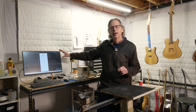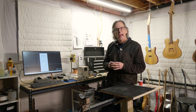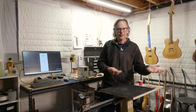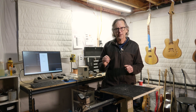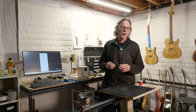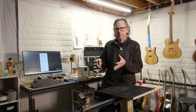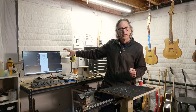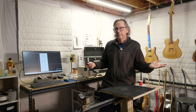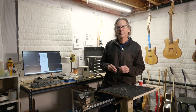It's to the point where all you have to do is stick a bobbin on there, feed the wire into it, send the G-code, and go back to doing something else. For five minutes, you've got a finished bobbin and it's going to be perfect. The software is working pretty well and it writes the G-code exactly the way I wanted it to, which controls the traverse and allows you to vary your different scatter patterns so you can get different effects and test how they sound in your guitars. I may even make the code available so people can play around with it — maybe some folks will write their own software to run this machine. That's the whole beauty of this DIY maker movement — it's kind of anything goes.